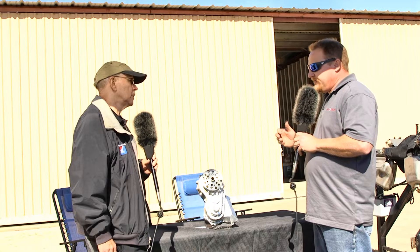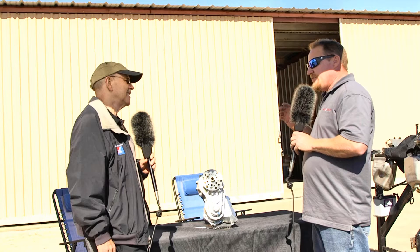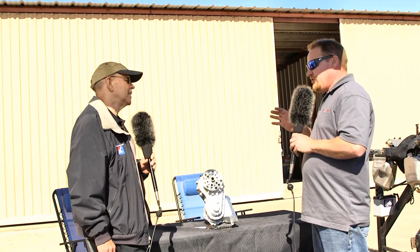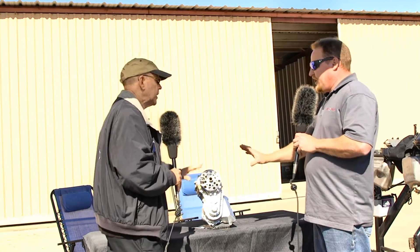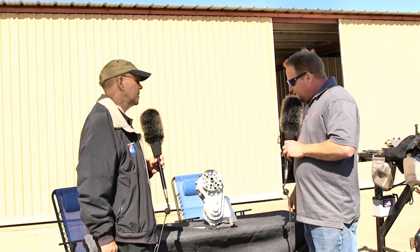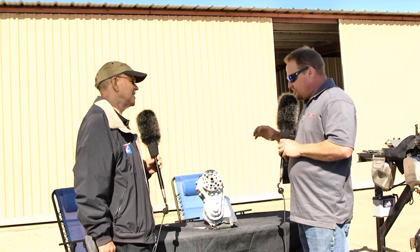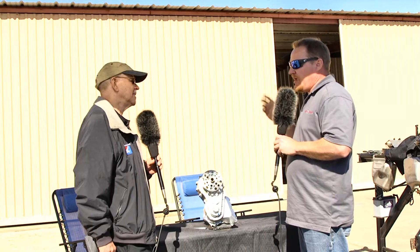After dyno testing and around 150 flight hours, Steve Henry of Wild West Aircraft came back saying he really liked it except the oil temperatures were a little higher than what he was used to — that's the gearbox oil temperature, nothing to do with the engine. So before going into production, still in test mode, I thought I could refine it. That's what led me to make the second generation, which is getting ready to go into dyno testing in Norway.